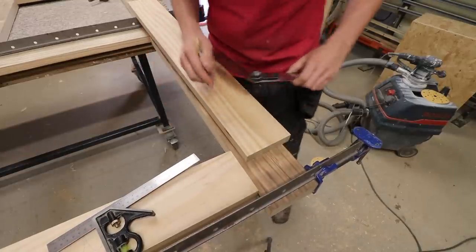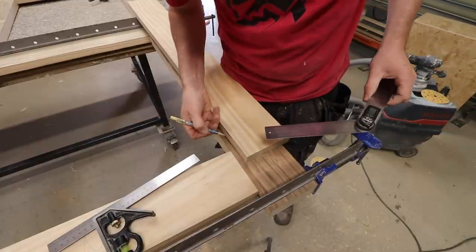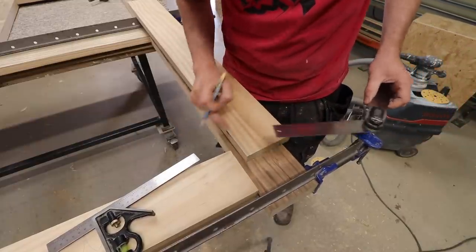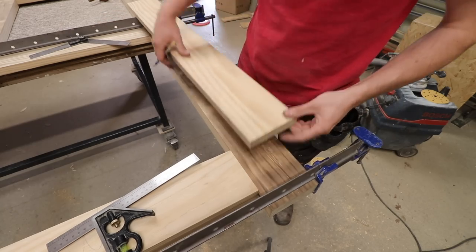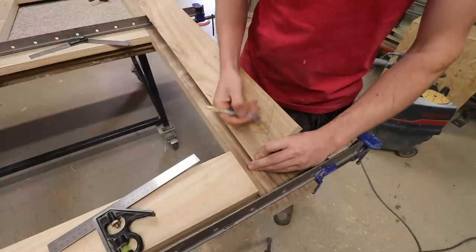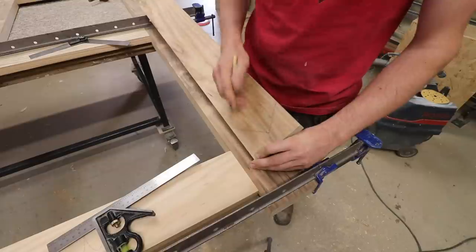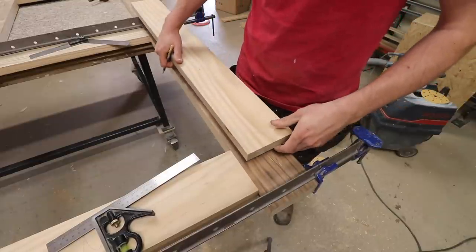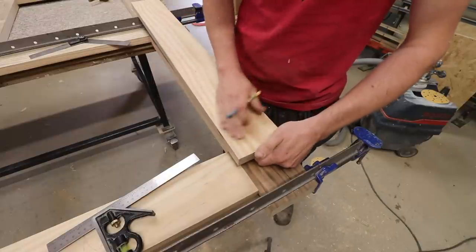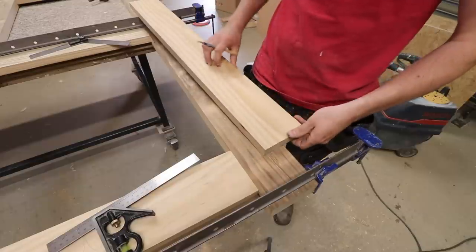That's the position of that top cut with a 9-degree bevel cutting back on itself. So that's really important that we don't cut that square from the other side on that point, or cut a bevel in the wrong plane. So you've got to get your head around that and make sure you cut that right. So remember, the line that you put on is the top side, and if you transfer it to the top, it's going to be right.